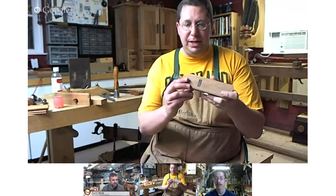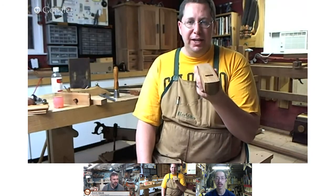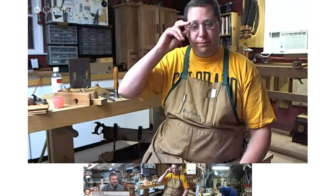Well, the little lines I have in the bottom of this apple smoother are essentially abuse. I'm putting this on the sharp corner of a wood that's three times harder than apple. It's bound to happen. You can't even call it a groove; it's more of an indentation. And it's only ahead of the blade, because that's where I'm bearing down a little bit. I knew when I did it, and I was like, oh, shoot. I grabbed the Veritas plane and switched to it, because I knew the Janka hardness of sapele is much, much higher than that of apple. So it's bound to happen. Yep.